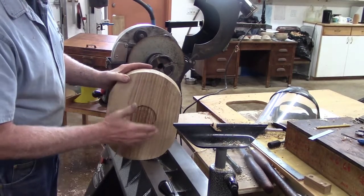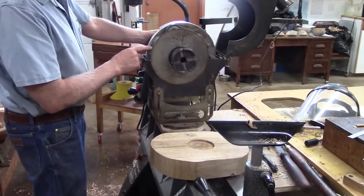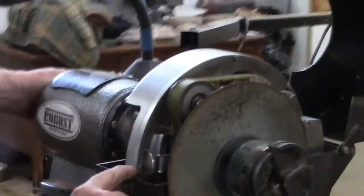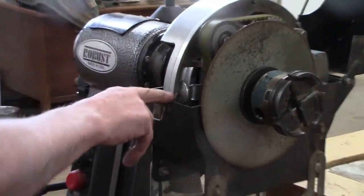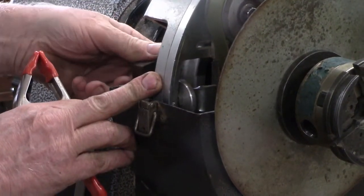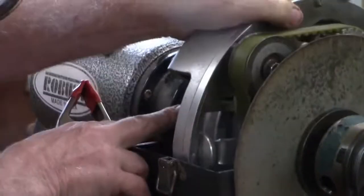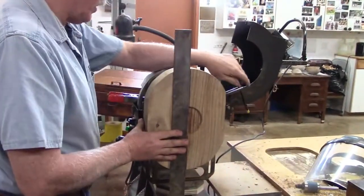So the first thing we're going to do is set it into the lathe. This point right here, if Roger moves a little bit to his left, this is the point of tranquility. So I'm going to set this chuck up right there. The Germans use the term point of tranquility. I use 9 o'clock on it because most people understand what 9 o'clock is. Okay, the chuck is set at 9 o'clock. My master line is going to be set at 12 and 6. Use the framing square to get the master at 12 and 6.